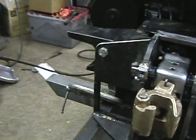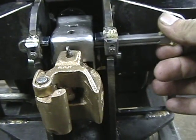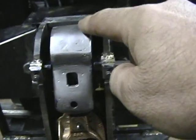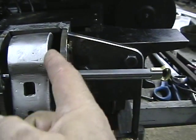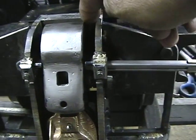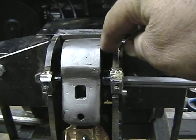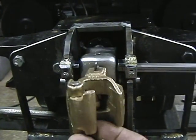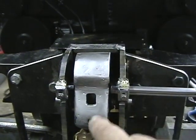To work this, you twist this little piece right here — which looks straight — and then you're able to pull the pin straight through. Once you get it through, it'll drop down. It's not balanced right at the moment; the counterweight up here should have an additional quarter inch of steel on either side. When I do that, it would come quite close to the side piece. I'm not sure whether I'll be able to apply those quarter-inch plates to make it balanced, but it's not that heavy, so I'd rather have the cutting levers on there.